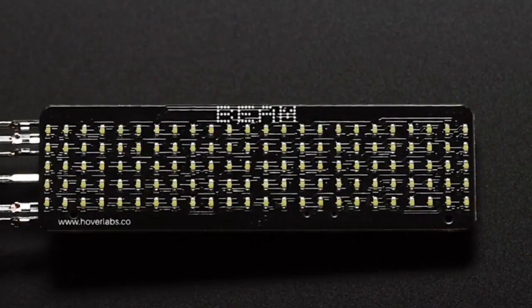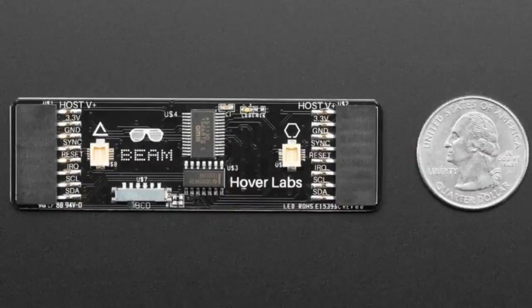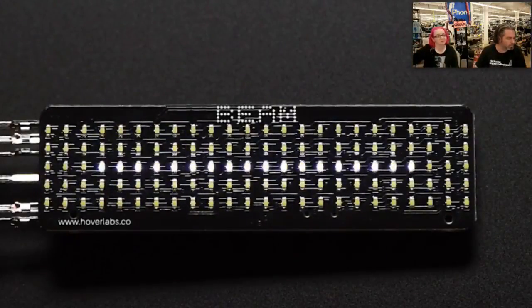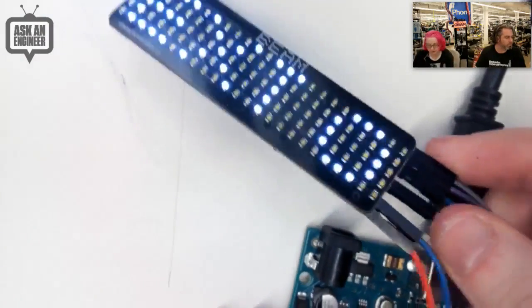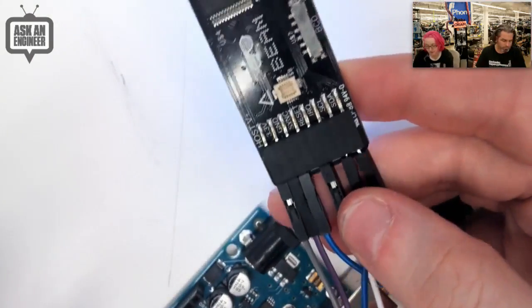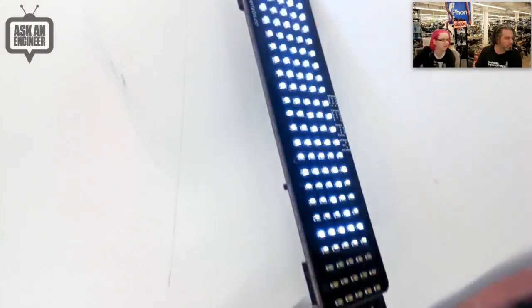These are — I thought these were kind of cute. They're little 5 by 15 LED strips, surface mount on one side with all the components and the driver on the other side. There are a bunch of LEDs and you can stack them together. You can put up to four together to make really long displays with text. They're nice and scrolling. Down the back you can select what I2C address you want, and there's code for Particle. It's I2C so it's very easy to use with any microcontroller. Just get a bunch of LEDs, it's just kind of cool — tons of LEDs and then stack them together. Good for making little displays.